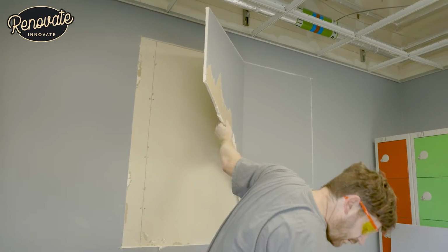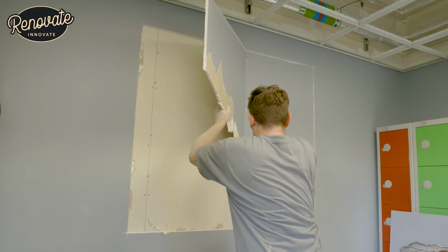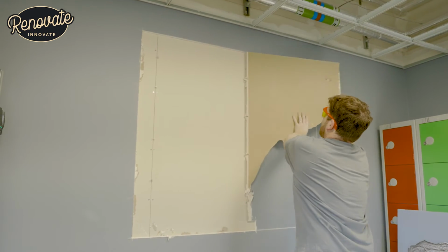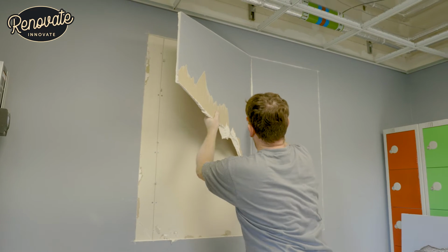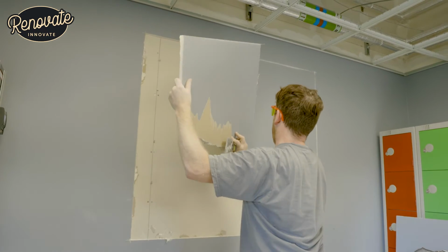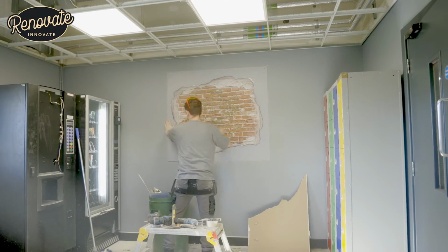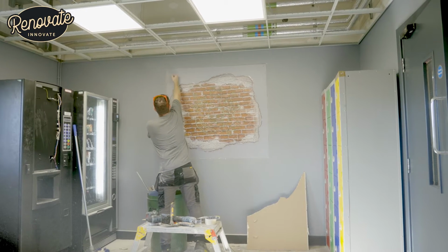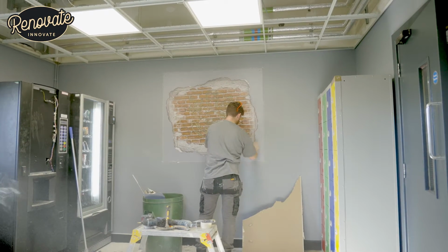We're just taking off these two layers of plasterboard. Now, they're normally there for a fire break, so what we did is we put another layer of MDF behind, which we coated in fireproof paint. And then we put the neon sign on top of that to make the neon sign sit flush with the wall, which is what we wanted. Yeah, just offering it up to make sure it fits before it goes down to have the LEDs put on, and also you see the different colour, we're going to end up painting that to match the wall.